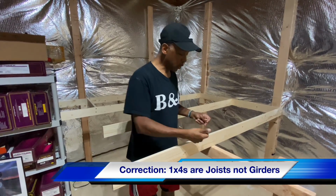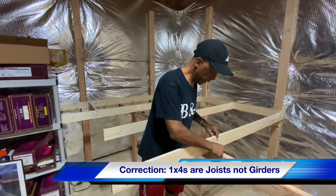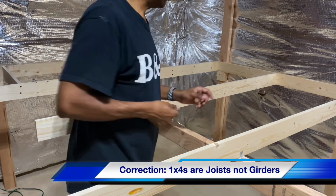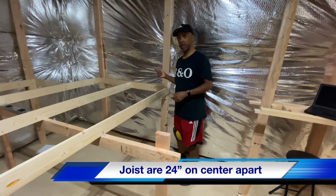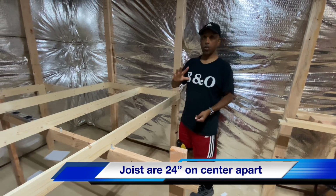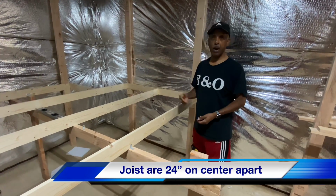What you want to do in the L girder is be able to screw from underneath to secure your girders. What I'm going to do is use these L braces like that and then screw those in. And I've already done that on my other table. Okay. Then on the back, for my legs, I'm using 2x4s that are full length, 8 feet tall. And as I explained in one of my previous videos, I'm going to put masonite against the 2x4s so that'll be my backdrop.